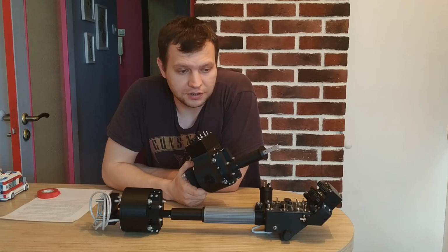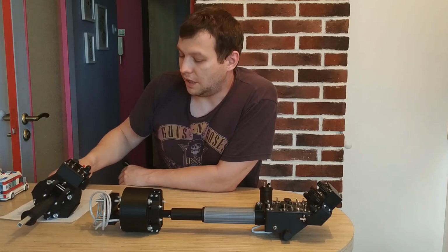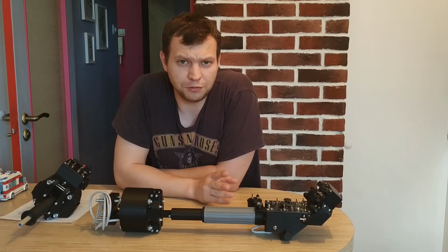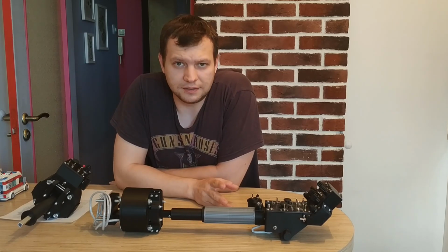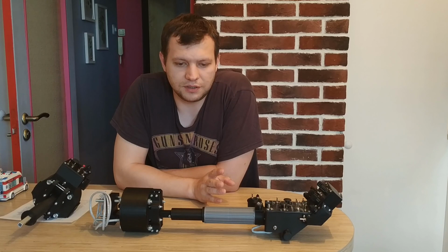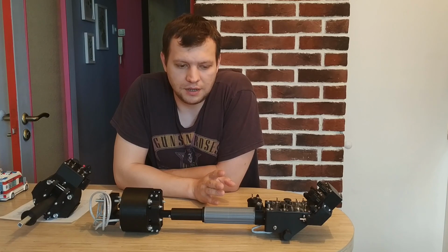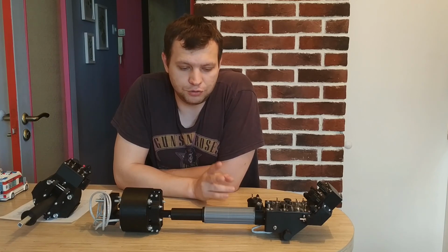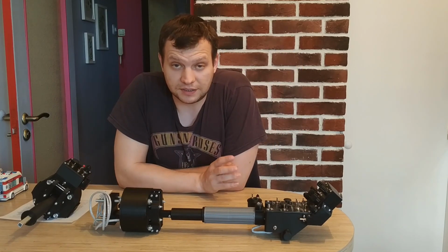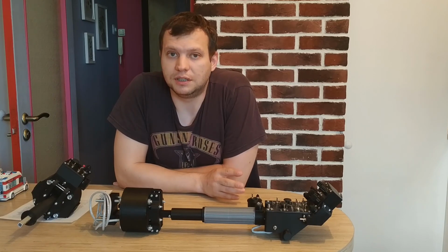I will be also showing the new Mark IV gimbal. I haven't talked about it yet in this video, because basically I have it mounted and I don't want to take it off because it's too messy. But probably the most important thing about it is that it's basically an improved Mark III reinforced gimbal. So the Mark IV one has 2 bolts for mounting the cyclic stick, and it has softer springs, and this allows this gimbal to work better.